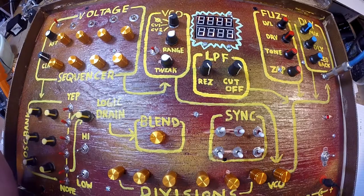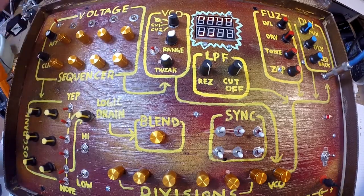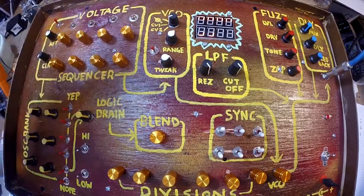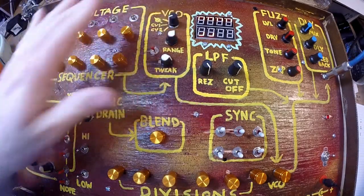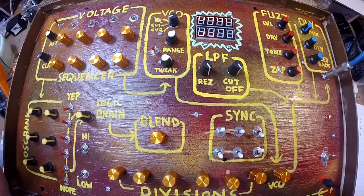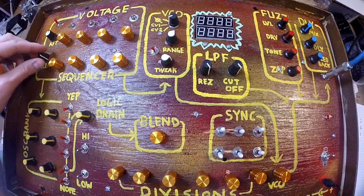And I guess the only thing I didn't really mention was that I really wanted the clock really slow between each step. So there's actually another divider right behind this 40106 clock thing. So you've got your 4017, 40106, another 40106, a 408 something, another 4040, a 4046, 741 op amp filter, 4069, and your PT2399 thing. And that's it, man. I think this beast is super fun. Just listen to this crazy nonsense.